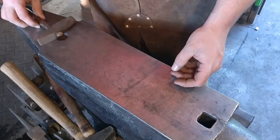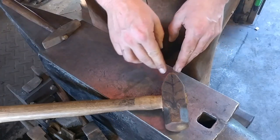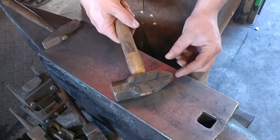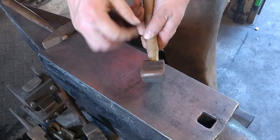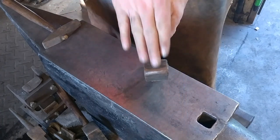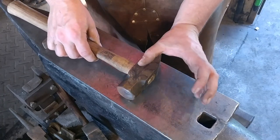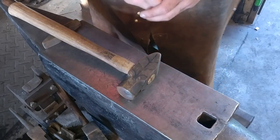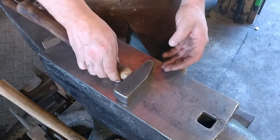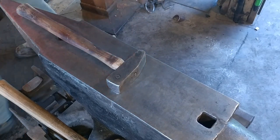Basically what we are doing is we are displacing the material. With the big hammer here: you are displacing the material in the same direction crossways of whichever way the peen is shaped. So if your hammer is a cross peen, you are lengthening the piece when hammering in one direction, and widening it when hammering the other way. I'm going to show you how that works in principle using my hammer, working on a piece of quarter-inch by one-inch flat stock.